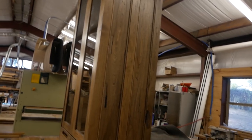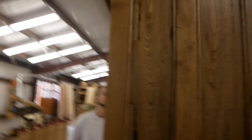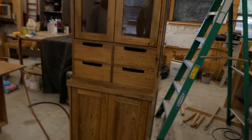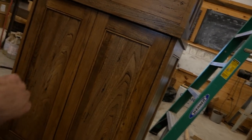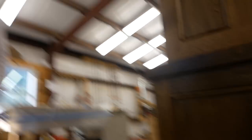All the panels on this cabinet are book matched, which was easy since we milled it out of beams. You can see the mortise — these are all timber frame beams with big mortise and tenons, and you can see we sawed right through one. You can see the chisel marks in there, which is a pretty sweet feature. These two panels are book matched but that one should be flipped — things like that happen, it still looks great. All around the panels we applied a bead detail that Ryan put in. We tried cutting these on the miter saw but it was borderline dangerous, so we set up a jig with a hand saw, cut with a dovetail saw, and used a shooting board to shoot the miters perfect.